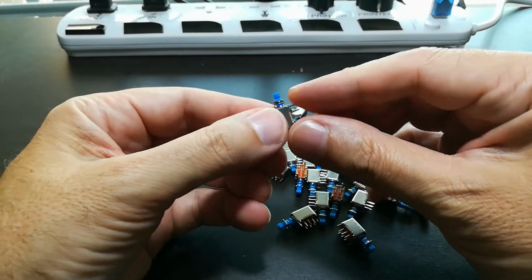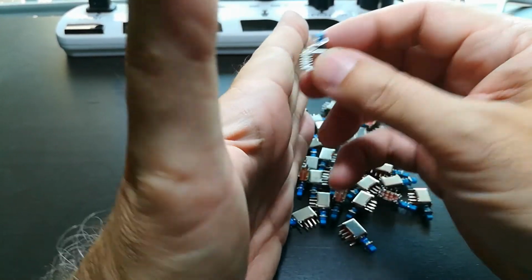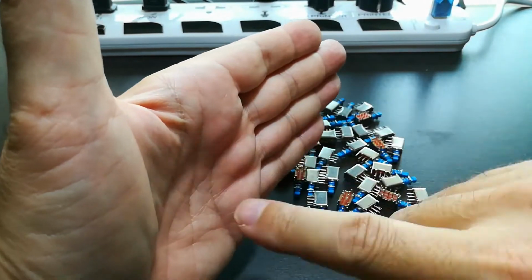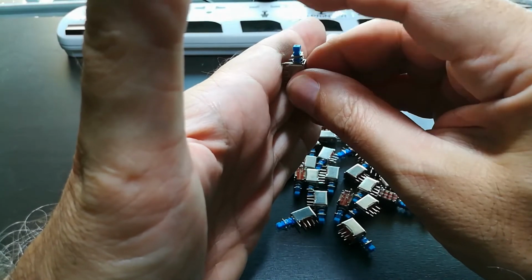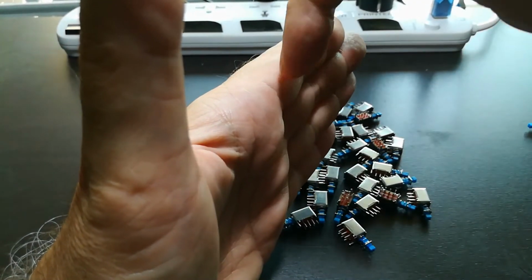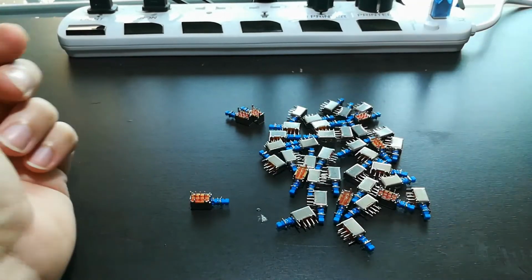And the cool thing is these are circuit board mounted switches, and they'll be mounted vertically on the side of the circuit board in the pack. So if we think of this as the circuit board, the batteries are going to be like this and soldered onto the traces of the circuit board. The switch will be like this, and I'll be able to reach it from above and connect it to the pack or isolate it. And then those little 6-pin connectors will be also along here, and I can attach the voltage measuring and the balancer to that. So this is the key for isolating the modules.